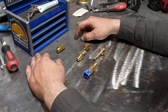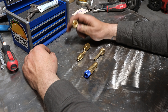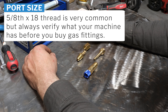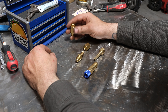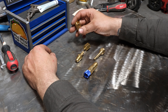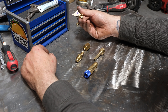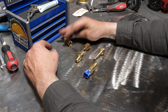Most of these are really only designed for gas usage. Your machine probably has this style port on the back; if not, you'll need an adapter. Miller is big on using the same thread front and back, but not all machines are like that. There are five or six different hookups for TIG torches, so make sure you verify the threads and get what you need. Links are in the description.